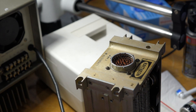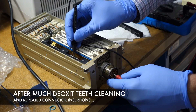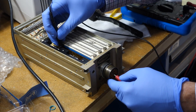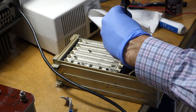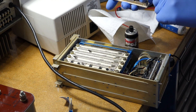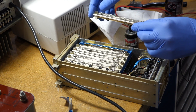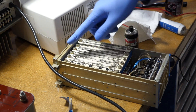Should we try connecting it again? So did we repair it? I guess so. Power pin goes to power here, ground goes to ground here — so that works. These are the dipsticks, which are their wire-wrap packaging technology used instead of sockets. The wire wrap pins are connected to the outer sockets, then the ICs go in, pinched between the outer socket and the inner socket, and go to contacts on the top. Those contacts are mostly used for decoupling capacitors and timing resistors and capacitors.